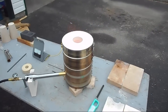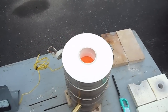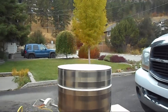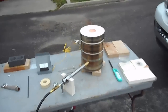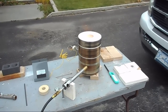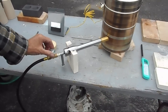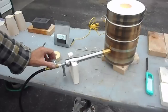The break-in of this machine takes a bit of time — it'll take a half hour or an hour before we can start playing with melting stuff. It's hot in there already, just under 1500 degrees. We've been going about 10 minutes now and we're supposed to maintain 1700 degrees, but we're now over 2000. So we're turning it down to see if we can maintain that lower temperature. We've got it down really low — it's not using much propane at all. Obviously a very well-insulated and efficient machine.